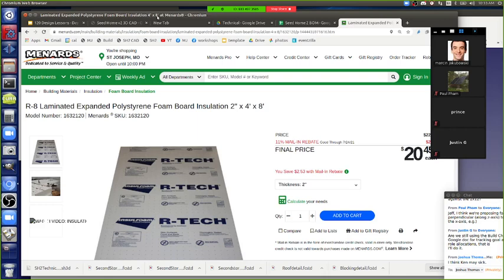Right. You said you need 25? 25 or 21, and then the roof would have to be 60. So maybe expand your walls to 25, which you can obtain from, say, 1.5 inch. That's R6, plus 19. R23 in the wall. 23? So you could do an extra 1 inch.